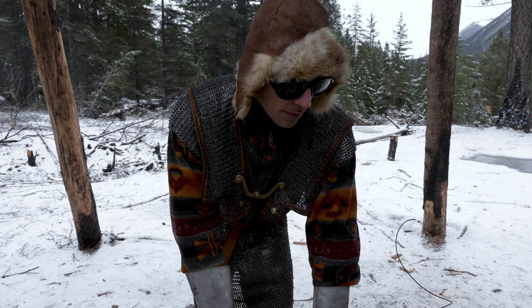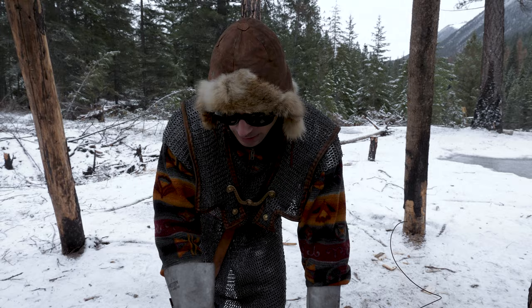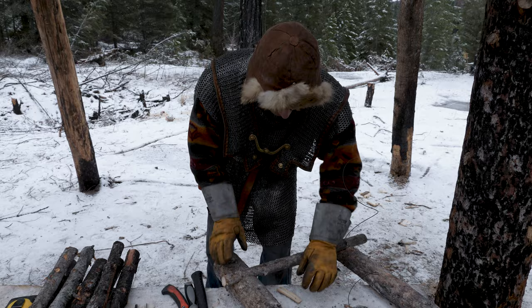It's gonna be nice and sturdy. And we'll come back later and then pre-drill. Put some nails, because right now if we don't pre-drill, it's most likely it's gonna crack, eh? We don't want that. We want it to last for quite some time. But all notched in like this, I think it's gonna be beautiful, nice and sturdy.